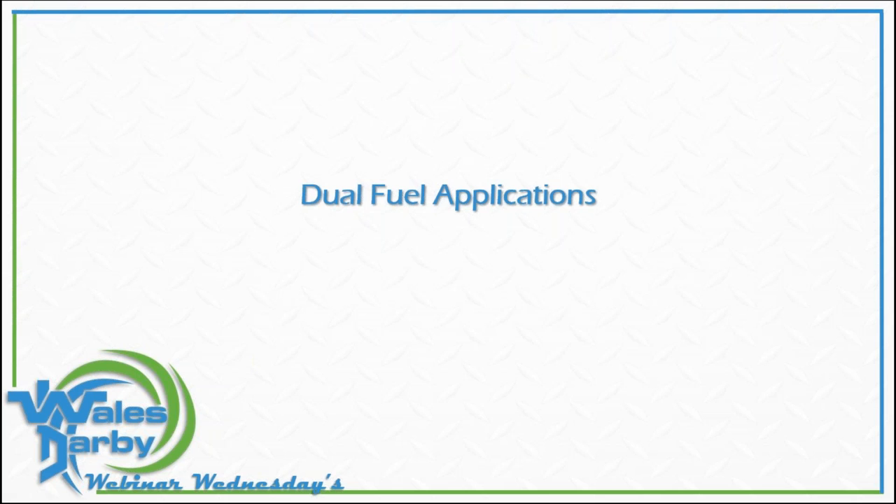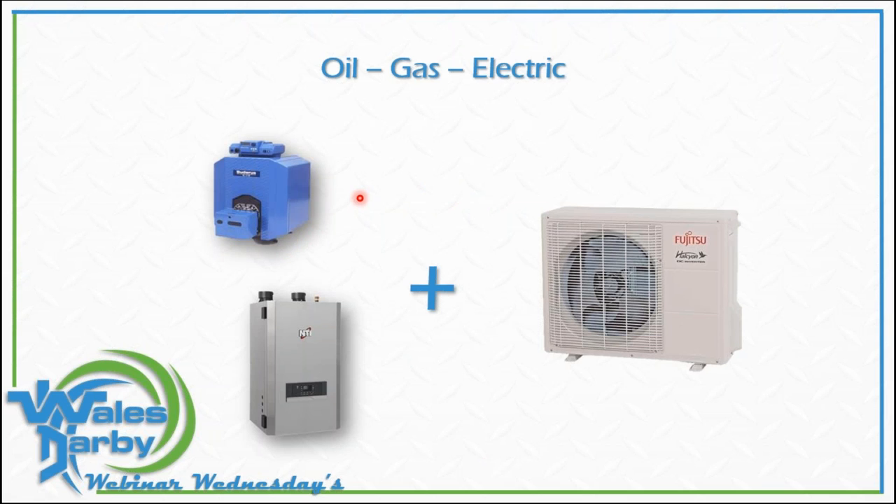So dual fuel — we're seeing a lot more of that. When I heard dual fuel in the past, I always thought of oil and gas: it was an oil system, and when it got too expensive we'd switch to gas, or when it got too cold into the teens and 20s, we'd switch to oil for the extra BTUs. Now it's more like oil and electric, or gas and electric. We're seeing these heat pumps come in — powerful and efficient heaters, more than capable of doing it. So why are we seeing that? A lot of it's rebate-driven, utility rebates. We had a conversation about strategic electrification — the government's demanding reductions in carbon, and we're going to see it whether we want to or not.